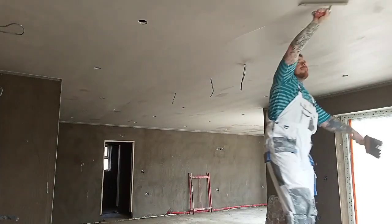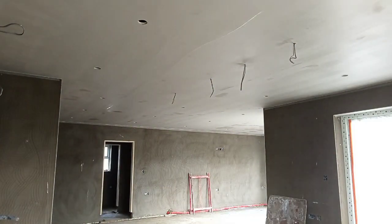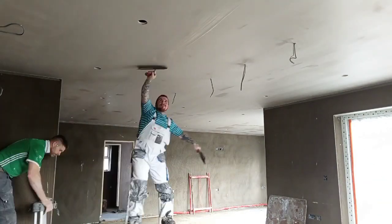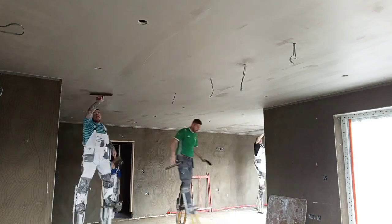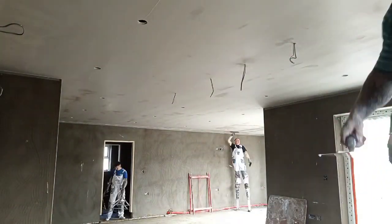As it's quite a large ceiling, Mark begins the next trowel from our starting point while I finish off the third pass. The pass that Mark is now doing, we use a flexi trowel. Some people absolutely hate them, but personally we find that once the set is starting to turn black, they're great for taking the pressure off the joints.